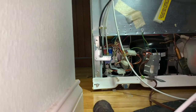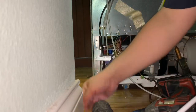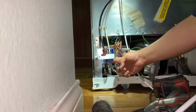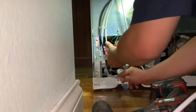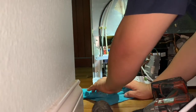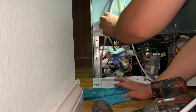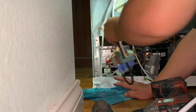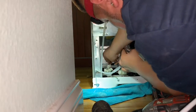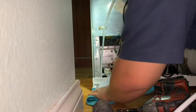So what I'm going to do is remove the water valve that is in the way. I'm putting a piece of rag to be prepared for any water spill. As you can see, I'm trying to remove only whatever is necessary to be able to get to the transformer in the back, and I'm disconnecting all the harnesses.